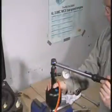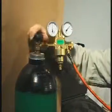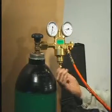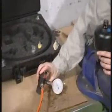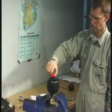Adjust the torque spanner to the value stated in procedure 903 and tighten the plug screw. Open the venting valve, close the valve on the nitrogen cylinder, then open the outlet valve and turn the spindle fully counterclockwise. Remove the filling valve and once again tighten the plug screw to the specified torque. Finally, mount the plastic plug.